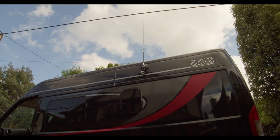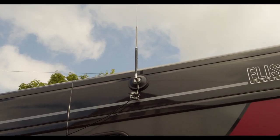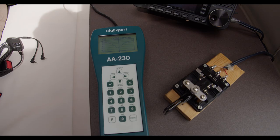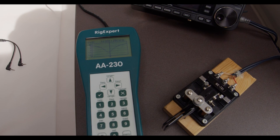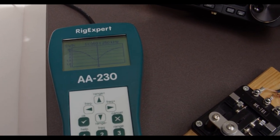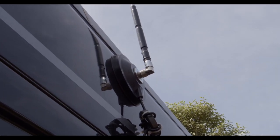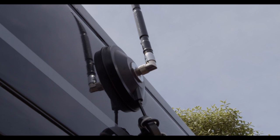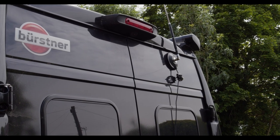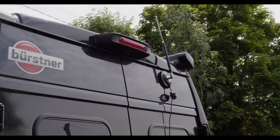That was the same position I used for the longer aerial, but this time I'm using the FX series — a smaller aerial with the base-loading coil near the side of the van. This gave me a reasonably good VSWR of 1.6:1 at resonance, as you can see on the meter here. I use a ferrite choke on the feed line and you can see the right-angle connection on the mag mount. I then moved the mag mount around to the back of the van, mounting it on the door as high as I could.